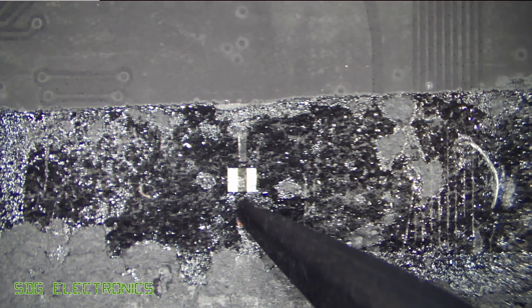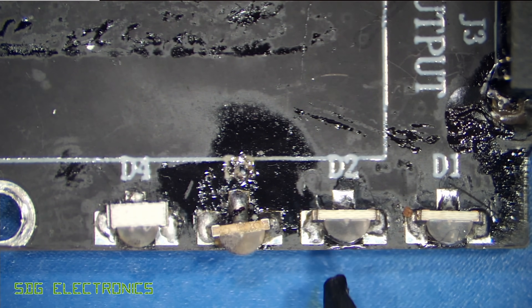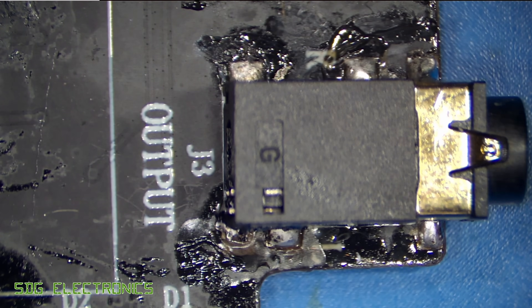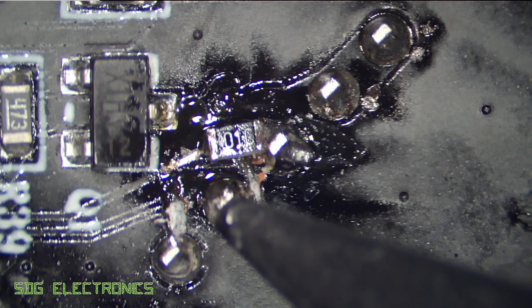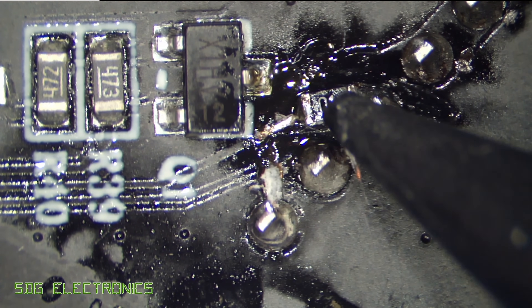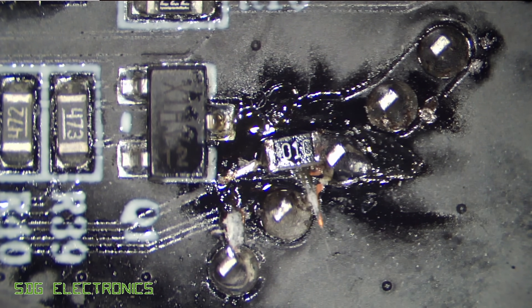Under the microscope we can see the rework on these LEDs is pretty poor. I think I've got some of these — I might be able to solder something on there. This one's a different type; these look like single colour ones, and this is the bi-colour one that had the blue LED. Here's the dodgy soldering around the headphone jacks. These might be easiest to remove with some low melt solder so we don't end up with a mess from melting the plastic. On the other side, here's the rework: they've sliced a track between two pads, and there's a track going along this way that's also been sliced with a resistor placed across it, leaving some copper from the traces behind.